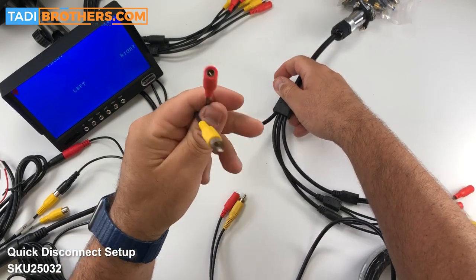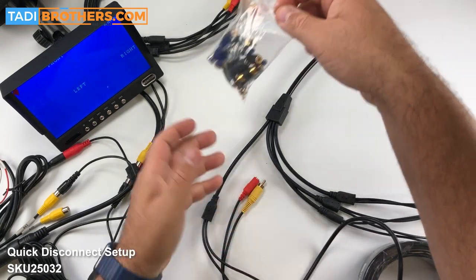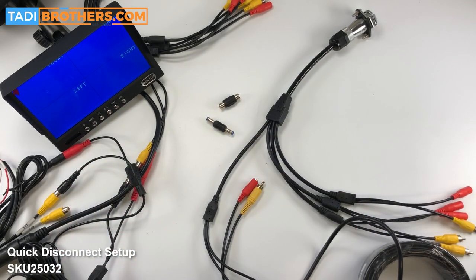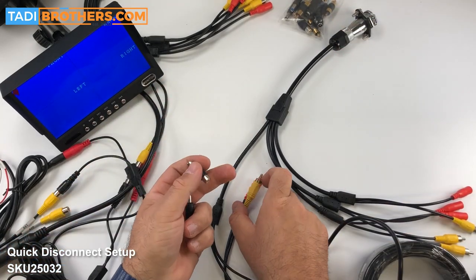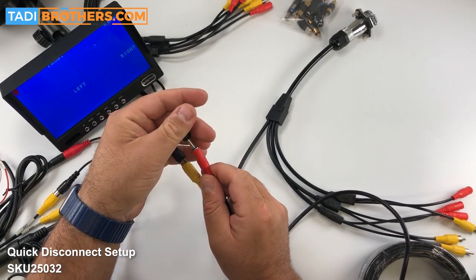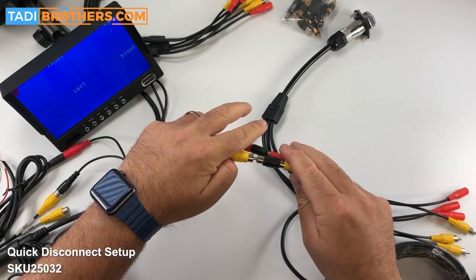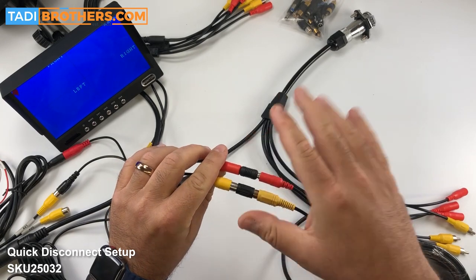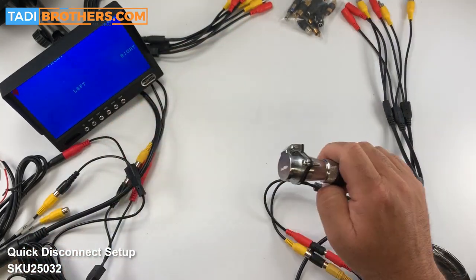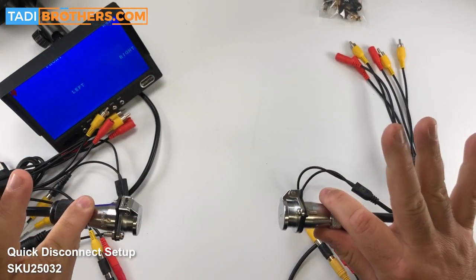We're going to find channel one, which is probably this edge right here, and connect them. But you see we now have two males and two females, so we go back to our baggie of connectors. I need a male-male DC plug and a female-female RCA — we provide you with all these in the baggie, and if you need more you can pick them up at a local hardware shop or just call us. So I'm first putting the connector at the end of the 50-foot premium cable with the power upgrade, then going to channel one on the harness and connecting that here. These connections are durable — they're not going to rust — but if you want, put electric tape around them. Once we do that, all that's missing now is the coiled portion.